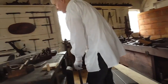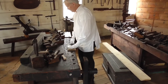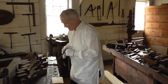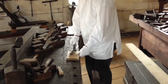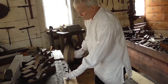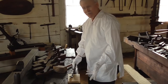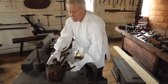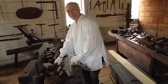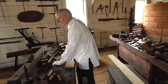So you've got your knee vise. You've also got some other ways of holding wood — especially with hand tools, holding things is actually a pretty big deal — and they also used what's called a hold fast. This was made right here at Old Economy recently — this is not an antique, it's maybe two years old. The way it would work: this is called a hold fast. You put it in one of these holes like this, you take a mallet and tap it in, and it's very tight. And so you can hold boards down and do whatever you want. Here's a couple more examples of Old Economy's mallets that were used. And to get that hold fast loose, you just hit it from the bottom — they would come loose, and they work quite well.